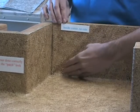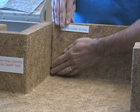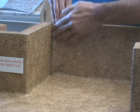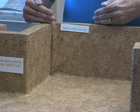On an inside corner, there are no cuts. Fold the material in nice and tight, take the excess material in that flap, fold it over — a nice waterproof finish.